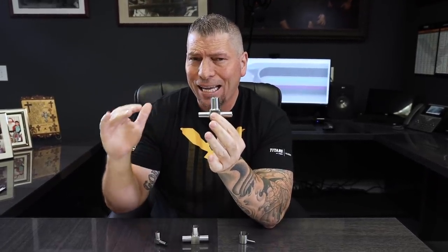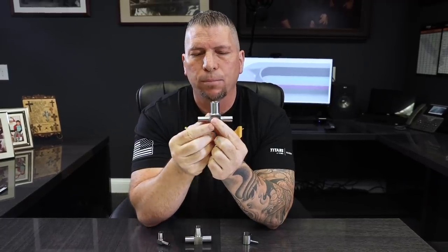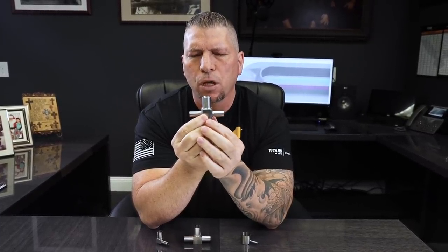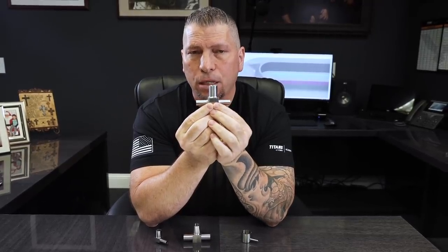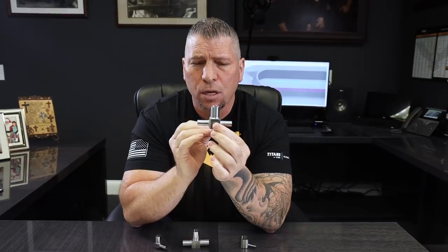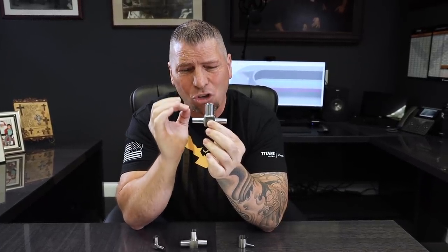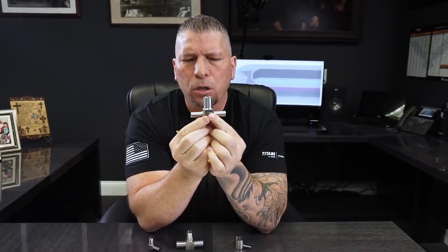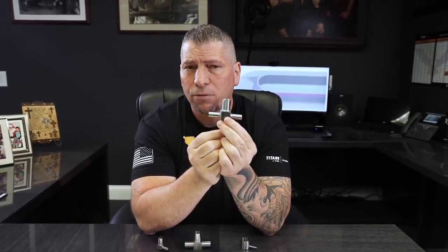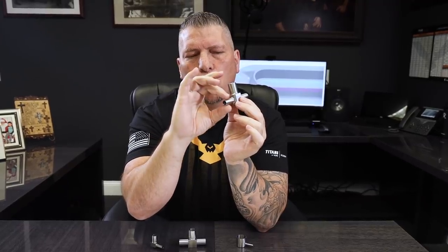Why can't these high-end engineers just order these online? Because the majority of off-the-shelf parts are made out of 316 stainless or copper. Where the money is, is making them out of titanium, A-286, Inconel — hard nickel alloys — based on applications, sizes, and tight tolerances. A part like this out of Inconel would often go for $500, $600, $700, because the tolerances — the ID to OD relationship — has to be absolutely perfect.